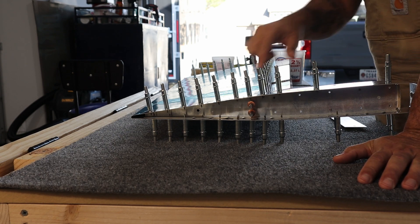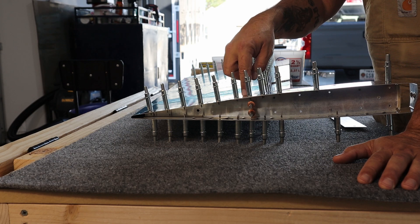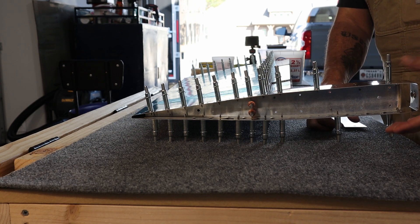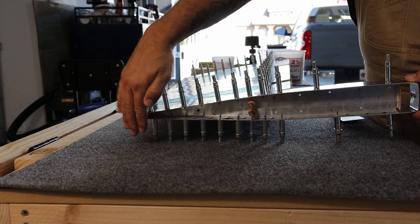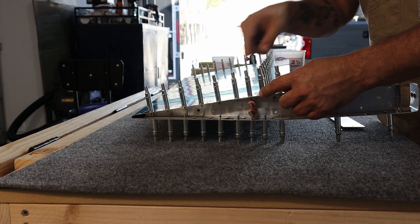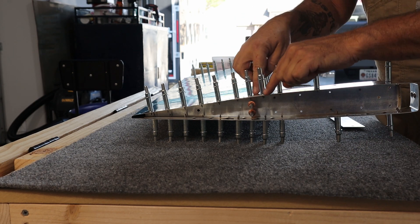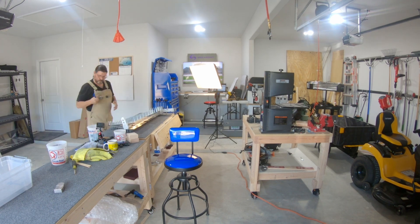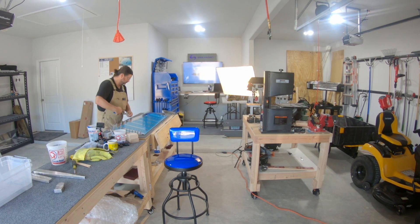Other than edge finishing and deburring, there's a little more work needed where the piece that holds the counterweight meets the fiberglass tip of the elevator. This is the outboard edge of the elevator and there's a fiberglass tip that goes on here. Where these two pieces meet, the edges have to be beveled to create a smoother transition. Now that I've confirmed the bend is good, it's time to take this whole assembly apart to prep the parts for priming and final assembly.